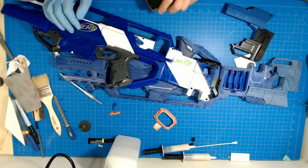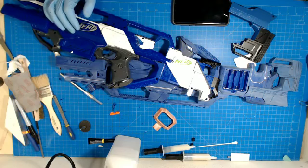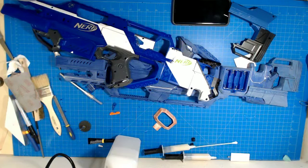I saw that thing in person, it's really nice. That's one reason why I don't recommend using UV LEDs though, is his parts have yellowed severely. Clear parts will tend to do that with UV lights or any sort of UV radiation from like the sun, unless you put some sort of additive into the resin, which I don't have, like some sort of UV resistant resin. But it looked good. There's a few bubbles where he did the resin, but that kind of can't be helped with his setup.